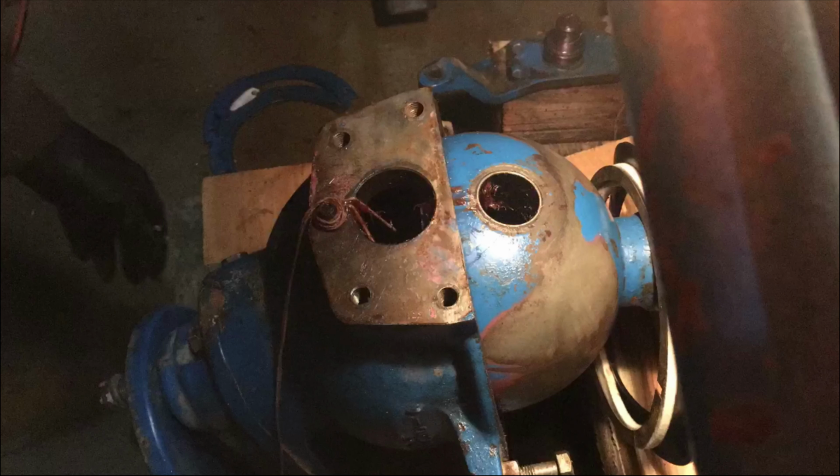The Ford tractor axle is now all back together. I did have a little trouble putting that final reduction gear case back on. My string method had some kinks to it. I had first tried the double wrap and then threading it through both holes for the Kingpin. I ended up scrapping that. You can't really see this in the footage, but what I did is I just ran the string with a single loop around the coupler up out the hole at the top of the final reduction housing. And then I took the string and I looped it around the locator pin for the upper Kingpin.